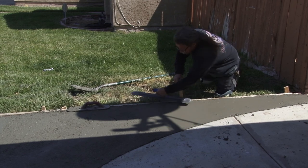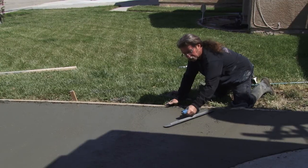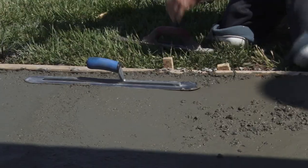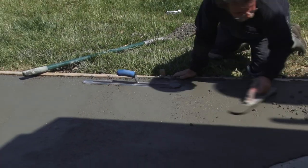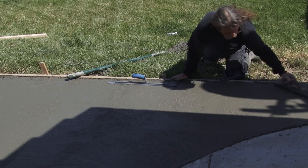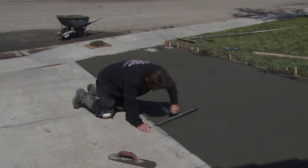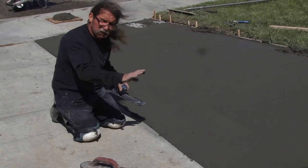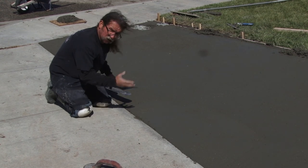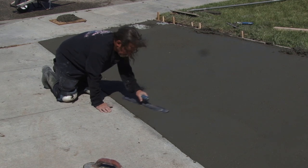Little pieces up in here will go really fast because there's not much material there — it won't take long for the moisture to leave the party, and when the moisture leaves the party, the party's over. We just have a slight tilt on the trowel. That reveals to us a little hole, so we'll fix that. It takes a minute right now to fix all these little issues, but if you take the time now, it'll make life a lot easier in another hour or two. Another good tip is to keep your edges clean. Remember, the name of the game is flat and clean.